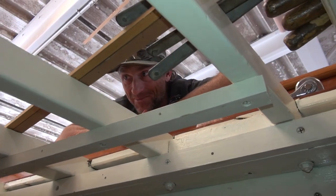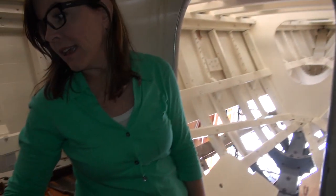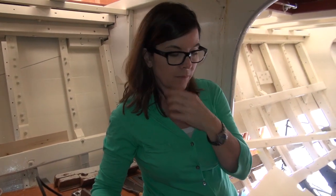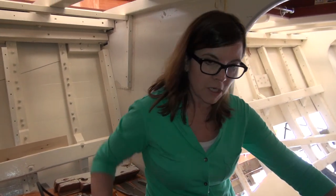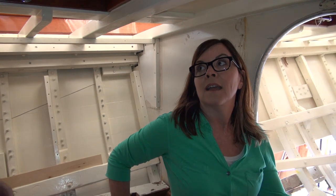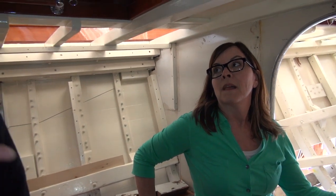The lids are fine to take off, but it's the framing I don't want you to have to take off — that's a house of cards. I think what we can do, because you've got to go in two pieces with this off, we can just slide the veneer in. Right here might be a little tight but there's wiggle room — especially once the other one's off. Cut it rough, slide the veneer in, glue it, and the next day when the glue is dry just trim it up. Overshoot it — that stuff is pretty flimsy so you'll have to be careful.